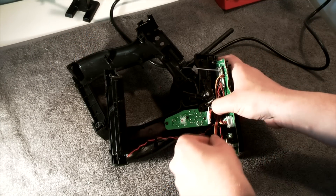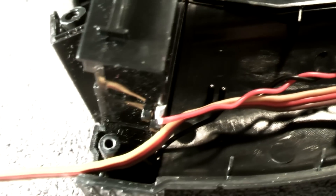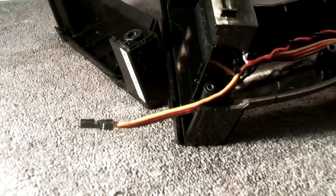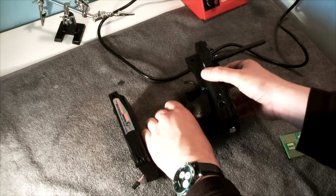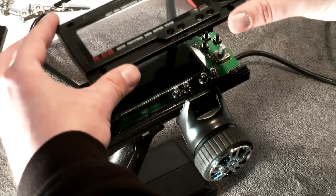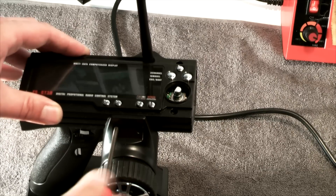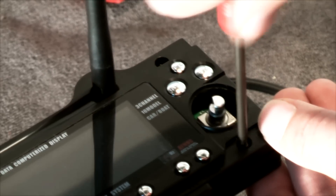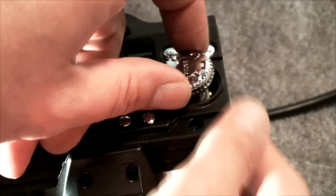Here's a more detailed view of how the GT3B has to be connected to the board. You can now place the wire down the grip of your transmitter. The GT3B can now be reassembled. Put the six screws back in, also reinsert the five screws on the back, and put your menu button back on.